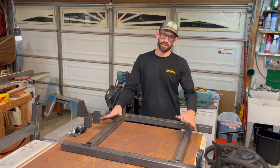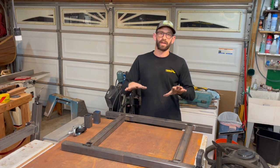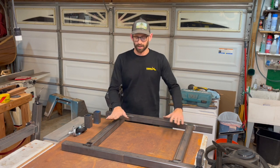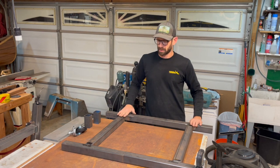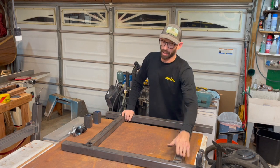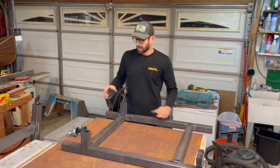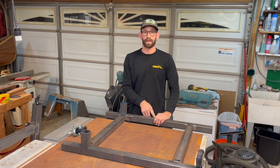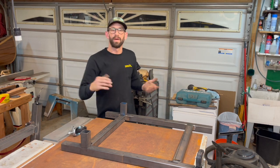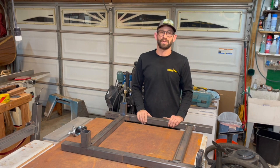However, the dolly that I'm going to use at the bow of the boat, I wanted to build some adjustability into, so that depending on exactly where I place it fore to aft, I can adjust the width of the bunks. My plan is to put some standoffs on the upper side, kind of in these positions, and then do the same thing as I did with these sliding rails. So this will be an upper assembly that the bunk is attached to. They'll be able to drop in here. That'll allow me to use these carts in different functional uses in the future.